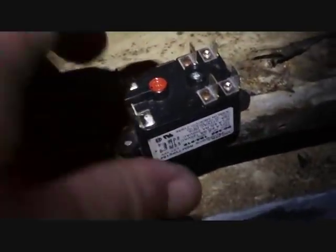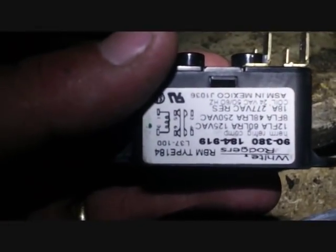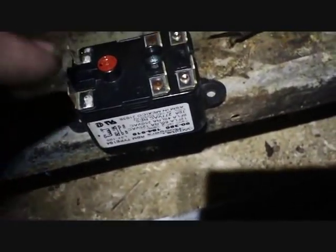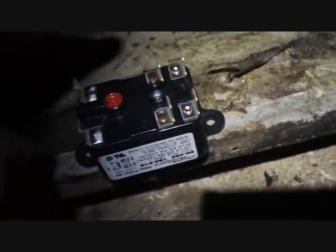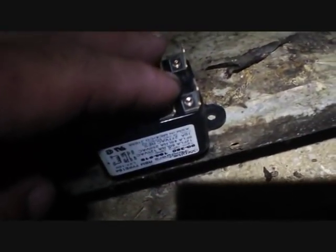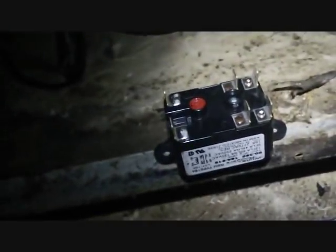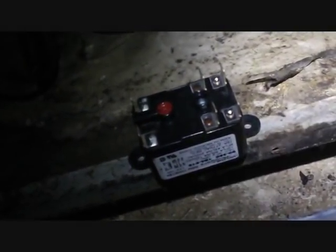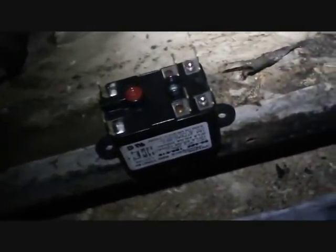Here's the relay I'm going to replace it with — just a regular relay, I'm sure everybody has seen this before. See the diagram on the side? One set of normally closed contacts, one set of normally open ones, and these ones on the end are normally open. When the coil is energized with the fan, they'll close and send the blower the power. I'll have the heat strips set up on this terminal and they'll jump across, so whenever the heat strips are locked on or they're on, it will also send the blower the power. That way you'll have a safety override — the blower will continue running if the heat strips are locked on, so there's no danger of fire or anything like that.